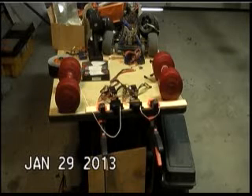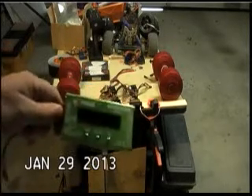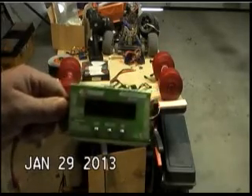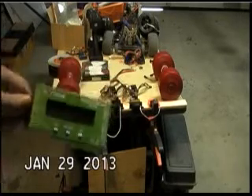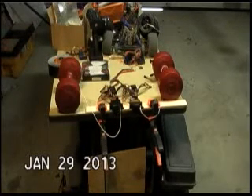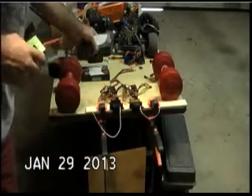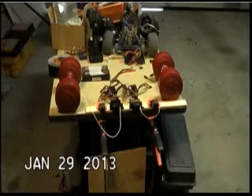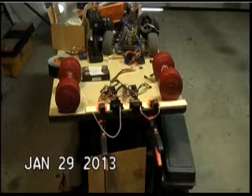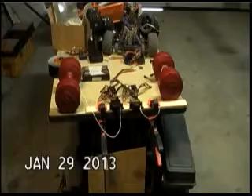In addition to my standard test, and this is all new to me — I haven't done any pre-testing beforehand — I'm going to use a power analyzer to track how many watts are being pulled from each servo, and try to discover which battery voltage is the break-even point for both servos. My prediction is that the Solar will need more voltage to pair up with the Saevox, but the question is, what voltage would that be?